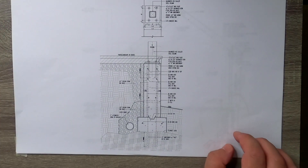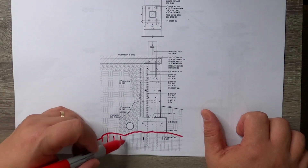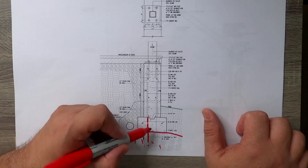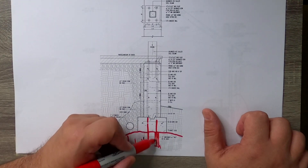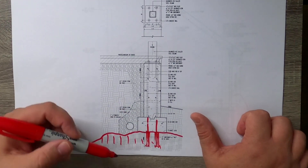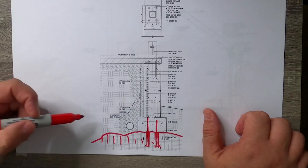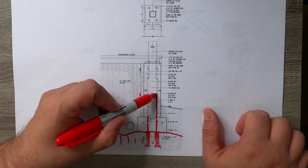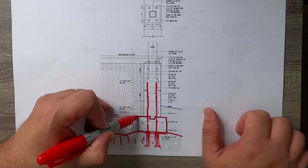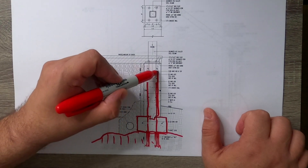Here's the ledge connection. Everything underneath this line is ledge — bedrock. What we did was install steel dowels — reinforcing rods — that go down into pockets drilled in the rock, and those rebar get epoxied in. They basically become a series of fingers coming out of the rock that we can cast our foundation around. Those rods go up significantly in height — they actually pass through the footing, which is cast down around them, and then a secondary rod captures the wall above.